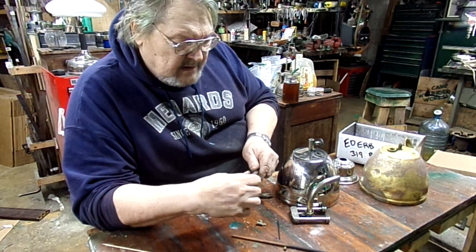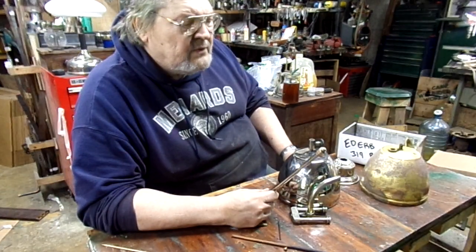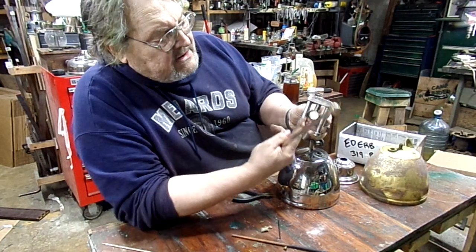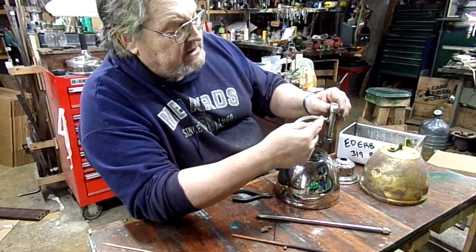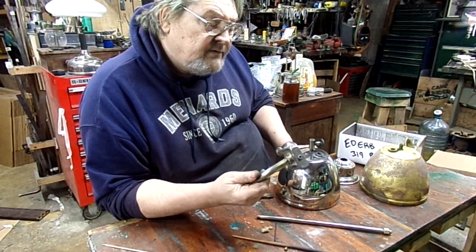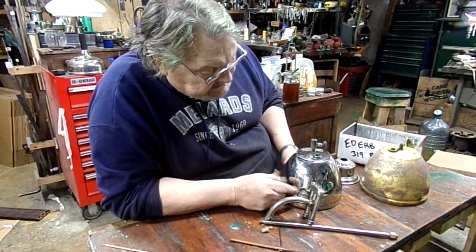So that's the Coleman setup — one of their early setups to figure out how to vaporize fuel. The burner assembly used on most of them today is pretty much the same, but the way the air is introduced back then was different. They wanted cool air coming in, so they put a snorkel tube which brings cold air away from the glowing generator and mantels.